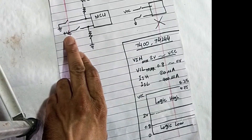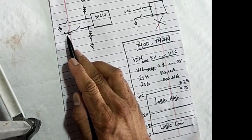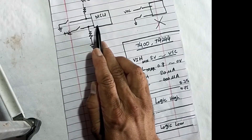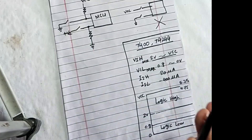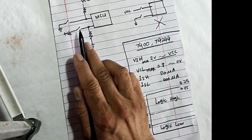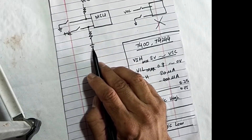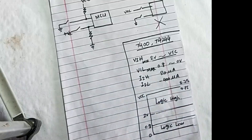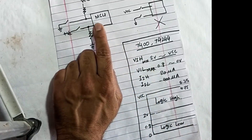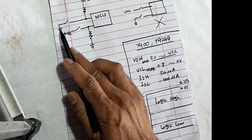We can apply positive voltage through a sensor or switch to the microcontroller. When the switch is closed, the microcontroller senses a positive input. When the input is removed, the same pin is immediately hooked to ground, so the microcontroller will not operate in that undefined state, and TTL, CMOS, or logic ICs will not operate in the undefined window.